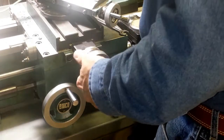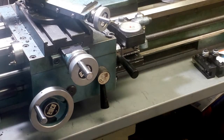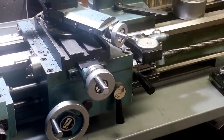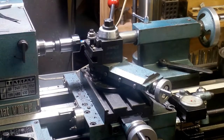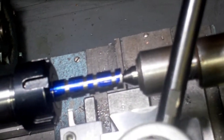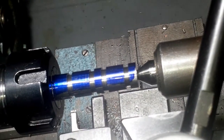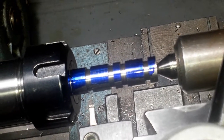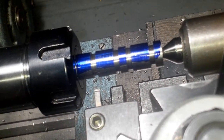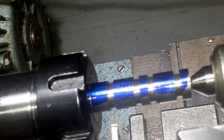I'm set up to cut that first one. I'm going to only go in — stay about 30 thousandths. I'm not going to film the removing of that excess material in there. I'll come back and show you the valve when it's complete.